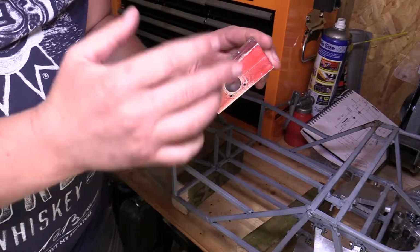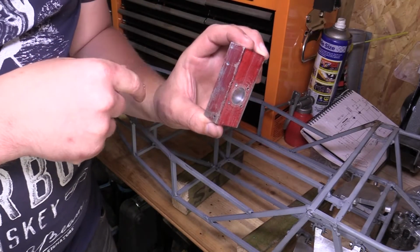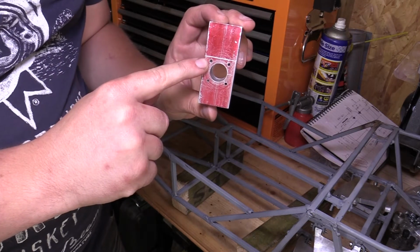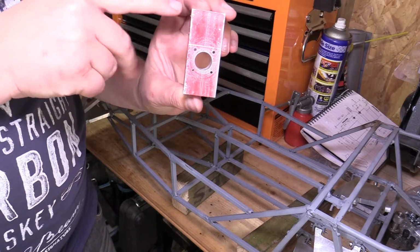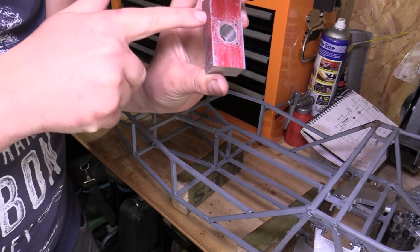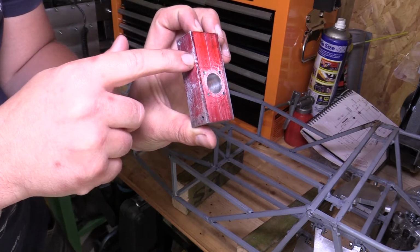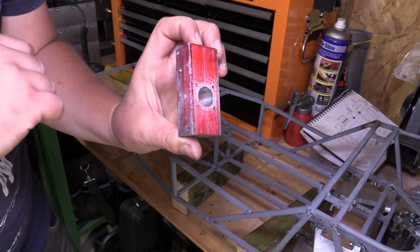Next thing we need to do is there's a few angles on the front and the back to be cut on this part. So the first one I'm going to cut is here, down to this line that I've scribed just above those holes there. So we'll be cutting an angle and across there until it intersects that line. I do need to drop this face back up to that line about 2.2mm. So I'll do that first, and then that will give me the point to where my angle needs to intersect.